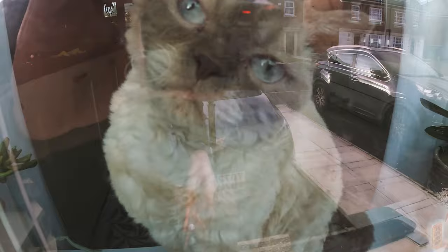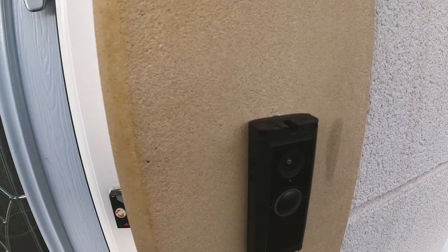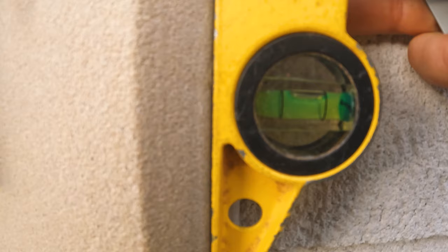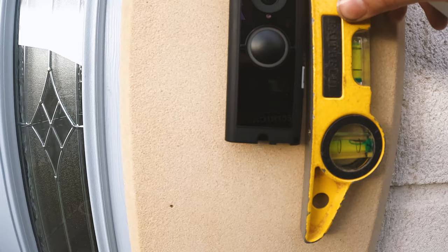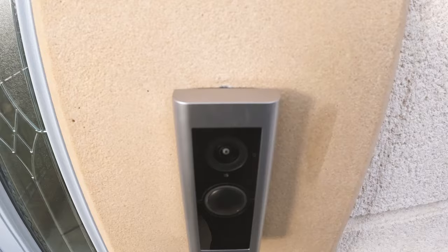I've done the same at the top. What I've done is got my Stanley knife and just chopped it along the top, so you can actually see the top of the plug - if you don't do that you'll see a little plastic hood over your Ring doorbell, which you don't want. There we go. So that's him fixed back then. Another note - you want to make sure it's level. When we put it up it looked a bit wonky. If you look here, the actual pillar's out - see that gap there to the left? So you've got to match that little gap. We've got a little gap to the left and it actually looks correct now. That's the security screw on, and that's looking absolute brilliant - perfect job really. No holes this side, so win-win.